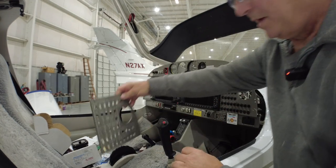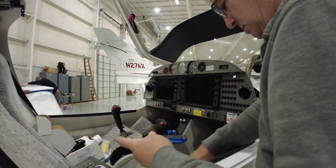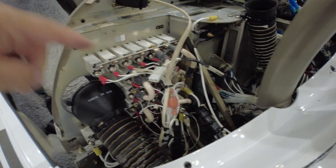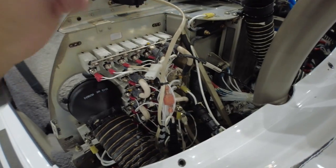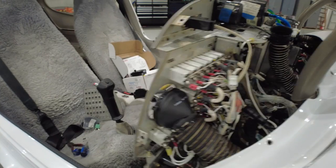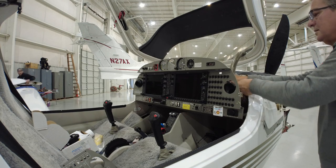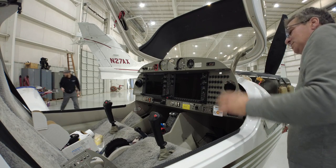Panel off. The three-amp breaker comes out; we're going with a one-amp breaker for the new device. So that's loose. Back here you can see our breaker that's coming out — it's got a bus bar that runs across the top that powers everything. The actual load comes off the bottom. We have to disconnect that, pull that breaker out, and pop a new one in. I'm going to have to pull this whole top row out to get the breaker off of it.